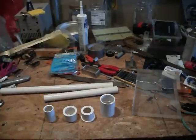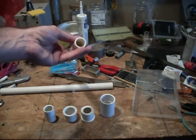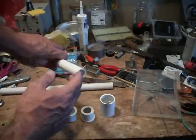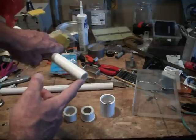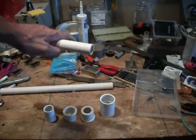These are the components I use to build my Vortex Cooling Tube Vortex Chamber, which is the business end where everything happens. What I'm using is 1 inch PVC tubing — outer diameter 1 inch, actually a little bit over 1 inch. The outer diameter isn't as important as the inner diameter, and there are certain ratios you should follow. You can go to my blog to see those rule of thumb guidelines.